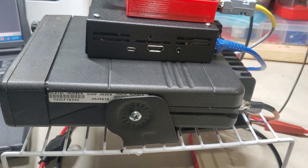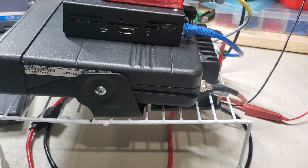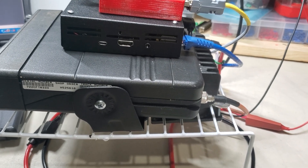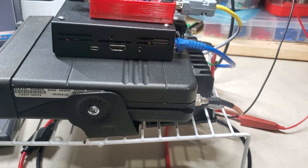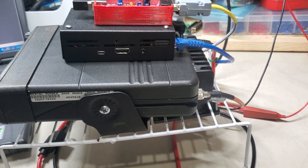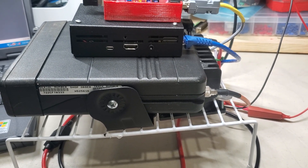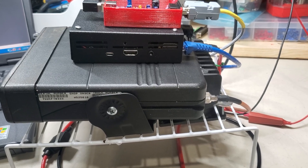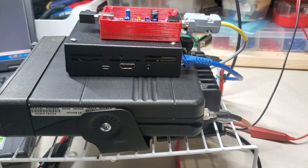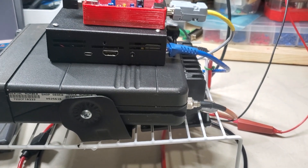I already tested this at 15 watts — it just gets warm after half an hour, and the fan is more than enough to cool it. That's the one thing you have to be careful with when you create these nodes. This radio puts out around 55 to 60 watts, but you never want to run it at max. I set it at 50 and did some testing, knocking down power until I found the happy medium at 15 watts. Remember, when the radio gets hot it's not good for the power transistors or the equipment. There are temperature sensing devices on these Motorola radios, so if it gets hot the power will drop to protect itself.